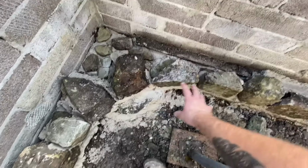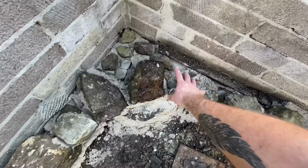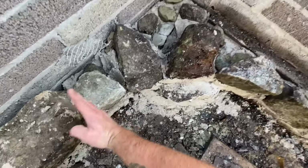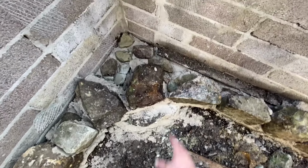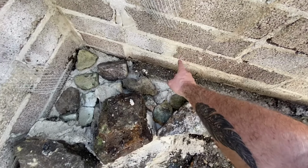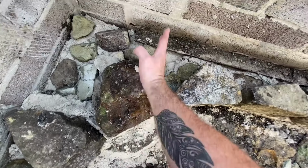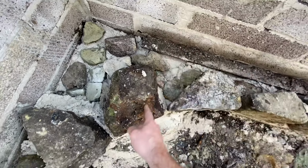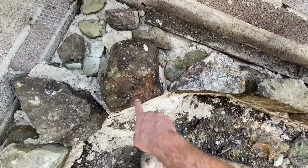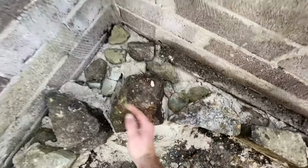But yeah, it goes all the way along, and I've got a curve in, which has all been signed off, basically. So what I've done with this curve is I've measured from this stone to the block wall. That was 79, and I did the same, measured off there, put a stone here, so that's 79. And then just to get my middle stone, I've measured off this point at 39.5, because if my math's right, that's half of 79, to this point. So it worked out about there. Then I measured from this point exactly the same again, 39.5 centimeters, and then put my stone in the middle of that, just so I've got a middle point. So from that to that is exactly the same.